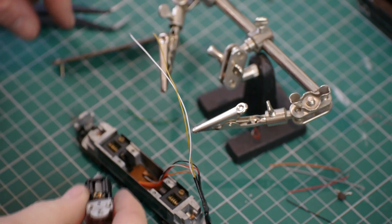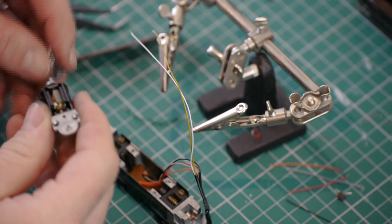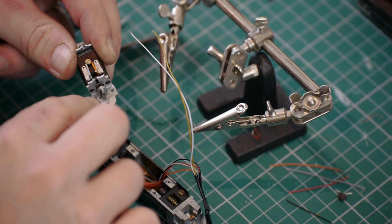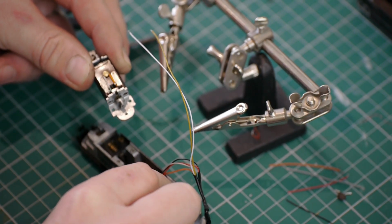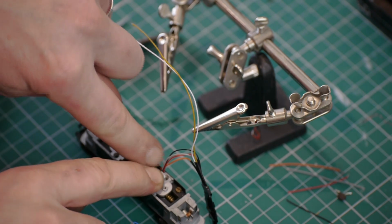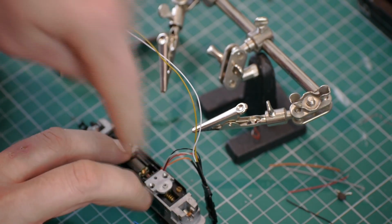With the cables routed and the lower board in place, it's time to get the motor back. Make sure that the little spline bits are vertical and that the worm gears are vertical, otherwise it won't go in. It's also important to make sure you don't trap any of these 4 wires between the motor mounts and the chassis.